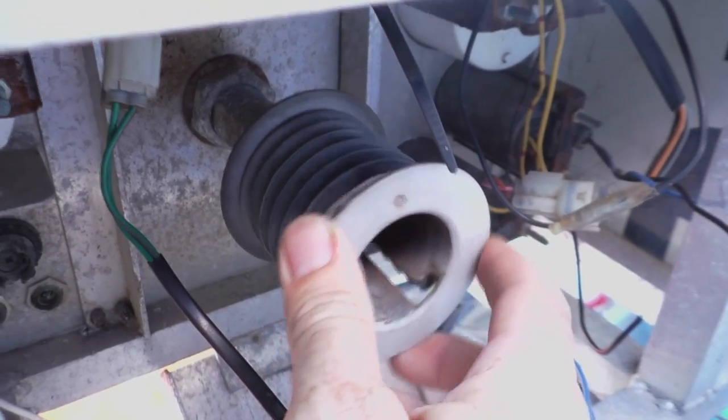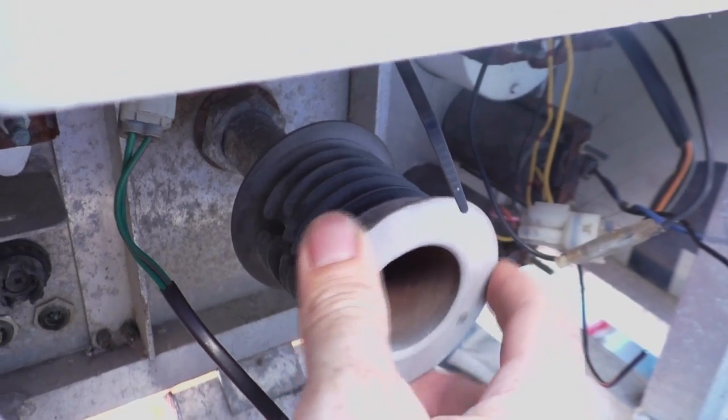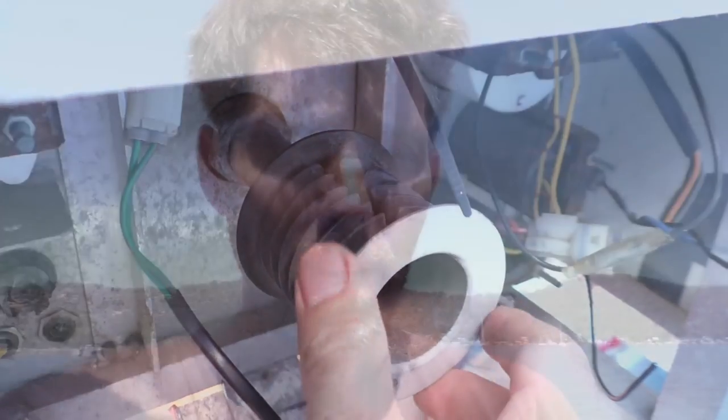This is the type of steering I'm talking about, where you've got this spiral drum attached straight to the shaft of the helm. The cable on this steering has completely snapped, so we're going to be swapping it out. I'm not quite sure how this one broke. It takes quite a bit of force to break these cables, so I'm thinking it's either been chafing on something, or it's actually physically been cut by some sort of incident.